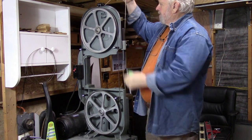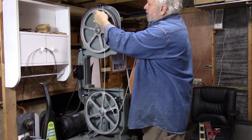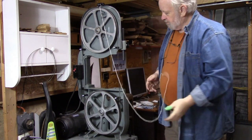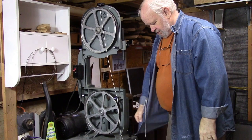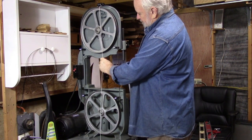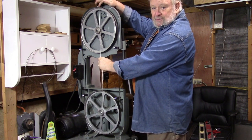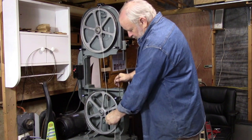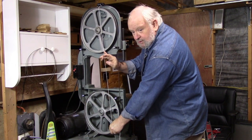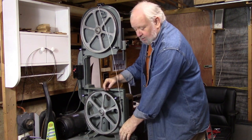In order to check it, what I've done is I've tied a string up here and I'm going to pull this string over the front. There are lots of different ways to check this, but this is what I have the most luck with — the string method. The string is touching on the rim of the upper wheel here. What I want to do is to see, just as it comes in contact with the rim of the bottom wheel, what is its status relative to the bottom wheel.